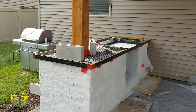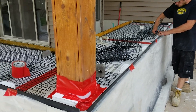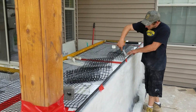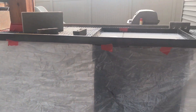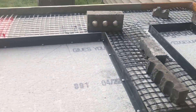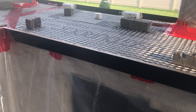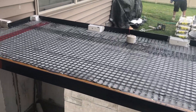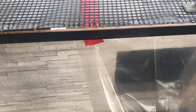The cement board and z-forms have been installed. The slate inserts for the countertop edge profile are also in place. The final pieces of the z-mesh reinforcement are being cut. For complete instructions on the installation of the z-form system, be sure to watch our previous outdoor kitchen video. Notice the small blocks of foam on the far edge — those are going to create the voids used for the installation of the decorative precast corbels along both outer sides of this counter. Make sure all your inserts have had form release applied. We recommend Walt Tools Form Shield because it's water-based and leaves no residue behind.